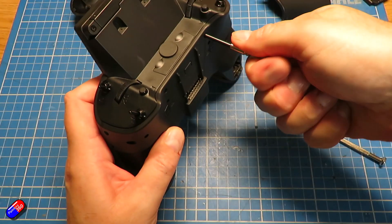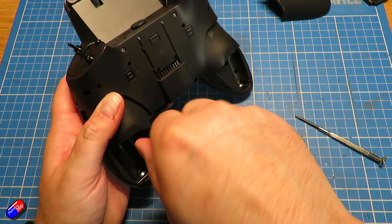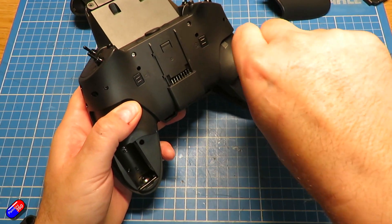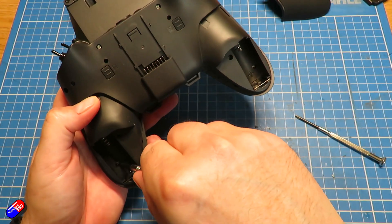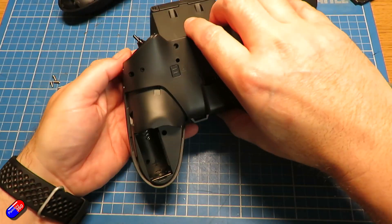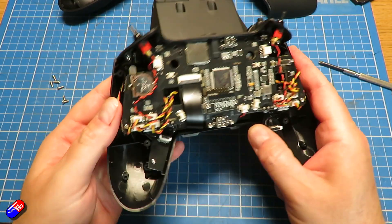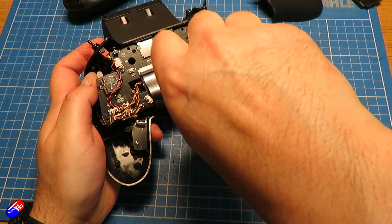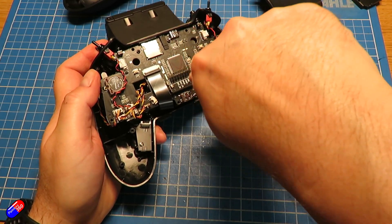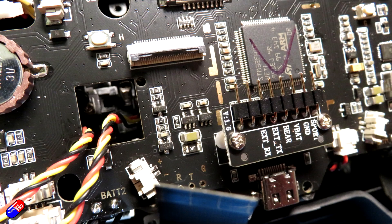I decided to put these into my Zorro. It's a great little radio, kind of replacing my FrSky X-Lite for playing around with stuff. Putting them in is a little bit of a faff — the Zorro is built like a little laptop computer. It's not difficult but you do need to give yourself half an hour and a steady hand. Remove the screws from the back plate and lift it off to gain internal access. Unplug the two cables from the power connectors on the back, then undo a couple of screws at the bottom of the PCB. At this point take a load of photographs of how it's all put together so you remember where all the cables go back.